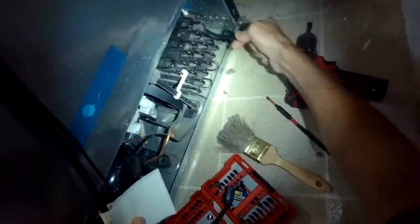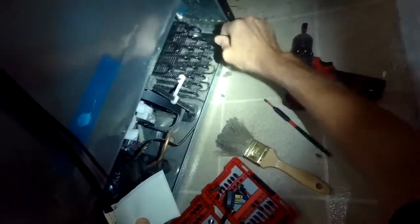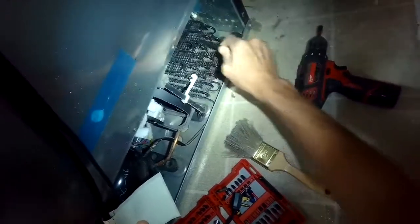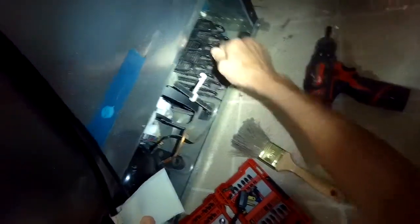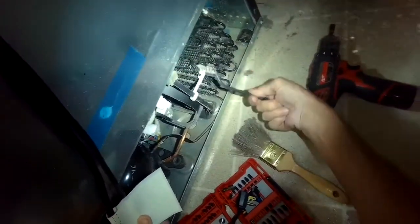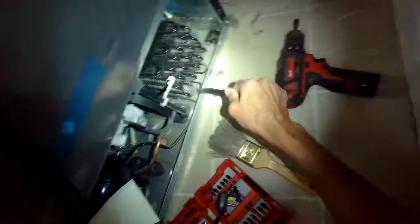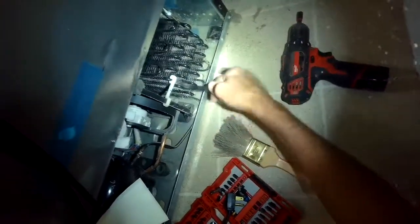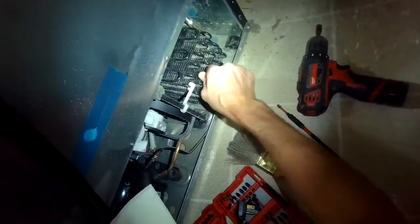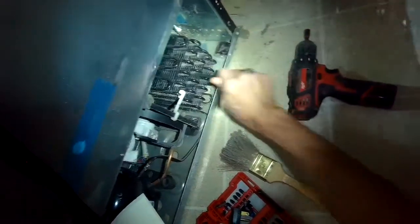This is a steel brush to get in there and get a hold of some of that dirt that's inside the coils. And you could also use an old toothbrush, that would work, or if you have a really skinny attachment on your vacuum, that'd be great. So not only loosening the dust, but getting the dust out of this general area is really great,